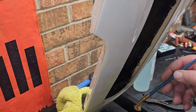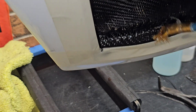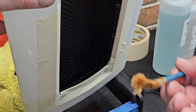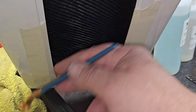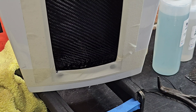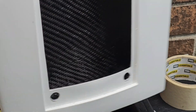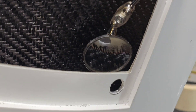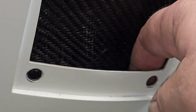This right here is overlapped onto the top side. It actually looks like it needs to go over a little bit more — I just slid it over some. See how the bottom overlaps very little. Before you start dabbing epoxy on this, make sure you've got it exactly where you want it. These long strings on the edge — I try to pull them off if I can because they make the final layup look terrible. I'm out of epoxy and it feels like it's all wetted out, believe it or not. I'm just going to use the remaining epoxy on my brush to finish wetting it out. I wanted to keep it light — that's six grams of weight total put in. Got this little mirror to check the layup.